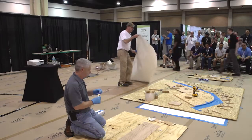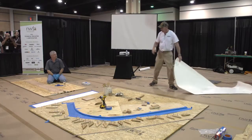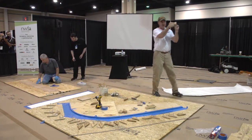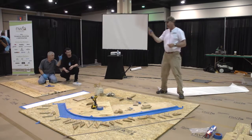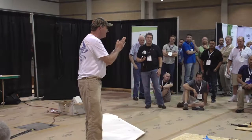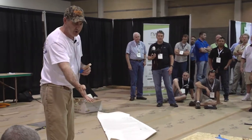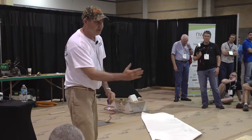This right here is a template. You can make it out of any piece of paper, flooring paper, what have you. What we did is basically cut all our pieces, and we put some X's across it while cutting through the table saw, and we mark every single piece 1 through 15, so we put them back together and get the same grain pattern when we glue it together. And we've laid it out, put some carpenter nails down, laid it flat and tight, and we're going to spread the glue.